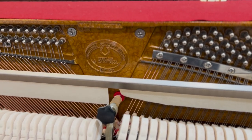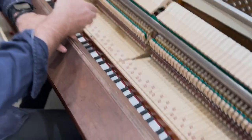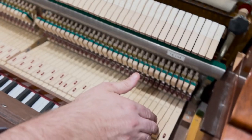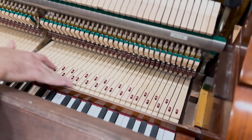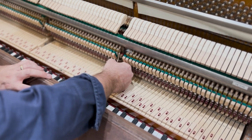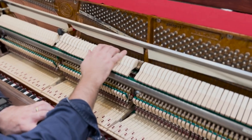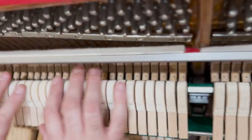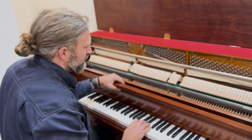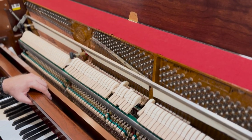The condition of the action is excellent. We need to vacuum out some dust and a little debris, but that's completely normal — we do that with every piano. All the felts are good, all the cushions on the back checks are good, all the leather is good, the tapes are good and very fresh, not brittle. The hammers have virtually no wear on them whatsoever, and the regulation is pretty good. I don't think we'll need to do much regulation work. The let-off is not far from where it should be — maybe just a check, but not much work needed.